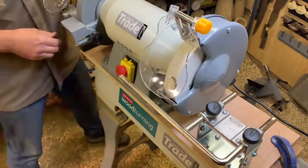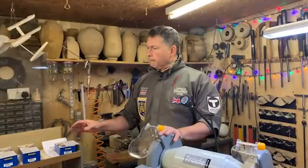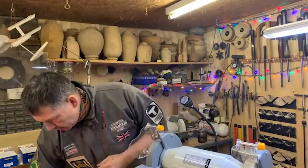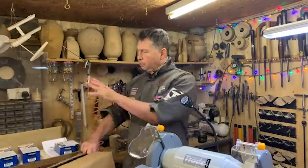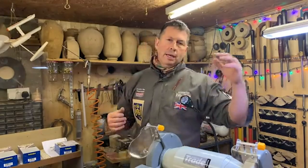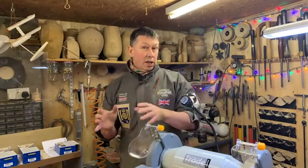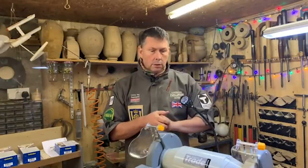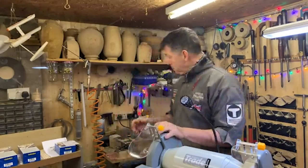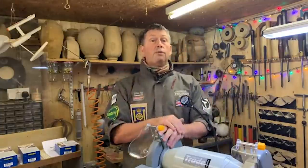So Charlie, let's pan back. Let's have a quick recap and a little bit of a Q&A session. We're almost at time. So that's a BGK-400. Remember, the BGK-400 comes as one kit, in a box like that, and gives you all the kit that we've just used, all the jigs. It's basically a woodturner's jig set, but it also gives you the ability to fix it to your bench grinder. So if you have no intention of buying something like a Tormek, but you want to use their jigs, because like I said, in my opinion they are some of the best you're going to get your hands on, and you want to use your bench grinder, do it. That's my perfect setup: slow speed grinder, CBN wheel, and this BGK-400 system, or the BGM, like I said, if you have some jigs already.